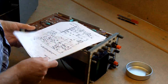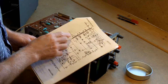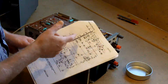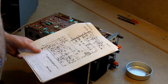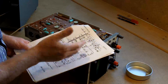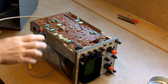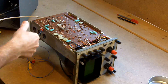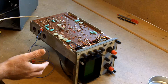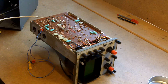What I'm going to do is identify the test points on here — they're numbered — and start at the power supply. The fact that I had that very distinct smell, and I switched it off — there's every chance that whatever it was may start cooking again. I'll leave the camera running when I first switch it on, but I'm not going to record everything because I don't know if it's going to take five minutes or five hours. I'm going to switch it on before identifying all the test points, because it might be needless if it starts to smoke.